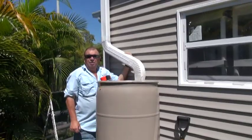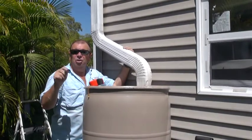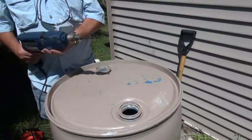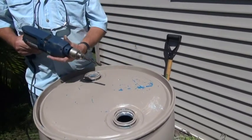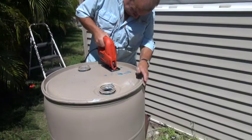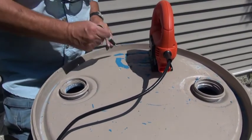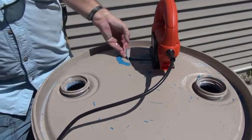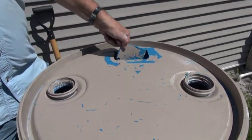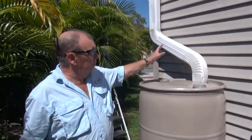Okay, I've assembled the downspout. The only thing to do now is mark a template and use a jigsaw to cut out a section on the top of the barrel where I'm going to put the downpipe in. I'll drill four holes in the corners of this cutout to mark it, then use the jigsaw. I don't want it to fall inside the drum so I'll hold it for the last half inch. I'll give the hole area a couple of coats of paint. The downpipe is now fitted into the rain barrel.